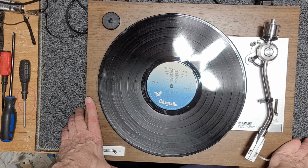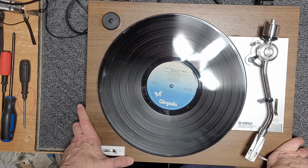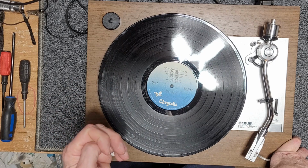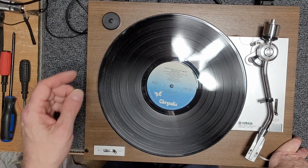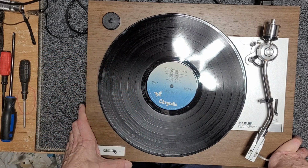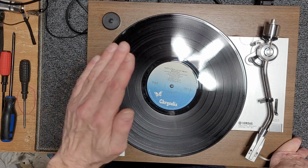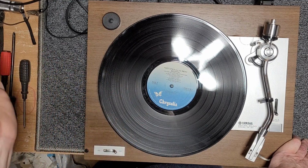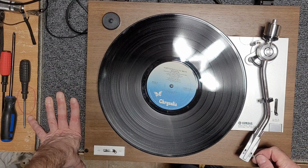If I were to guess what the issue was, I would be very certain that it was the pulley on the motor. The belt residue that was on there was very, very thick, and it was very uneven, and I have a feeling that the belt was moving up and down on the pulley. The pulley has to be completely smooth, so the belt has a nice rotation on there, and the belt will tend to stay in the middle of that pulley. But if you've got all this guck on there, the belt's going to ride up and down, and that's what we were seeing there. And even just slight variations in the belt going up and down would be enough to throw it off, let's say, a couple RPMs on either side. So it might have been going from 31 to 35 or whatever, right? And that is very noticeable. But since then, I have not heard anything.